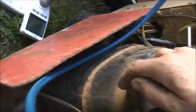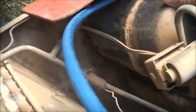1 amps. Yeah, it's going down a bit. It should be getting all the way here cold. Hot up here. There's some boiling in the compressor. That's probably an overload, but the current meter does not show that it's overloaded on the compressor. 8.7 amps, just kick-started.